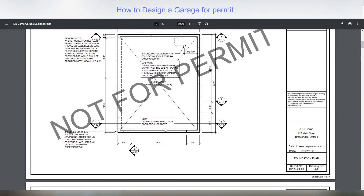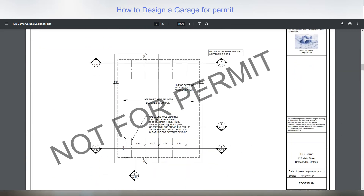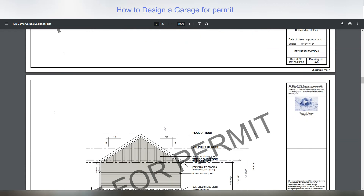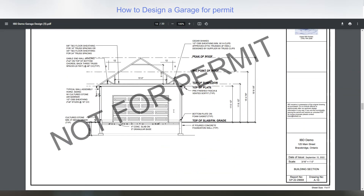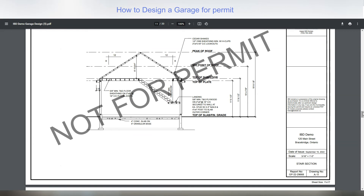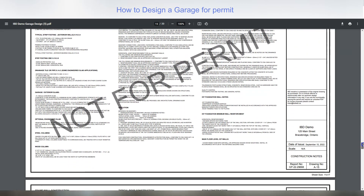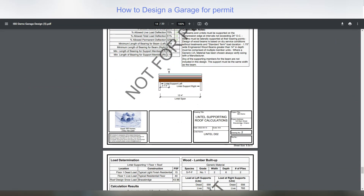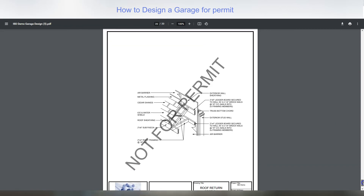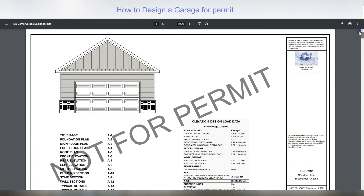You can see the front elevation with the stone and door — it's loaded for the location with all the notes. We've got the stair, all the different loads, the loft plan, roof plan, all four elevations, a building section, a building section through the staircase, wall sections, door and roof details, general notes, and all the lintels required. Each lintel with a point load will come with an engineer seal when purchased. There's also a roof return section detail.